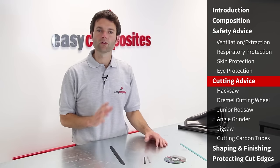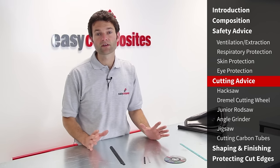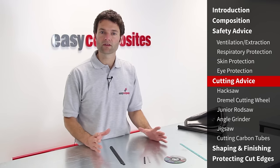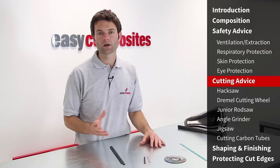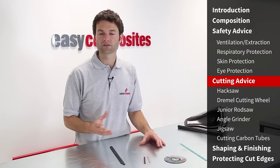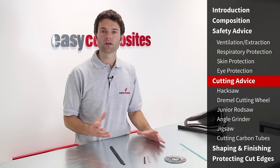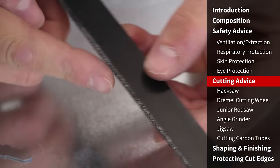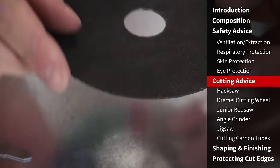There's nothing particularly difficult or unique about cutting carbon fibre. Many people assume it cannot be done without expensive or specialist tools, but this is not the case — better, more appropriate tools make things quicker and easier, but you can cut carbon fibre with fairly standard tools. As a general rule, you want the cutting surface to be as fine as possible: a finer cutting surface will splinter and fracture the laminate much less. The best blades don't in fact have teeth at all — instead they have a fine grit on their cutting edge, like a permagrit hacksaw blade or a ceramic slitting disc with an abrasive surface.